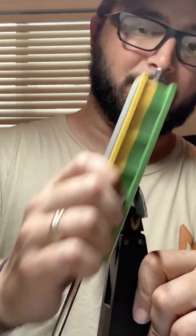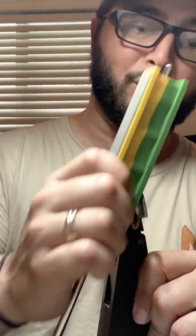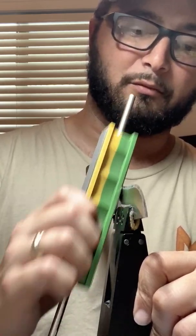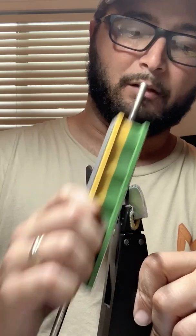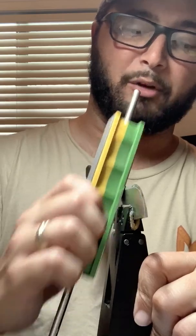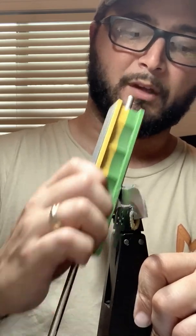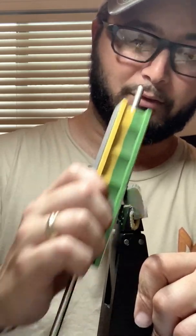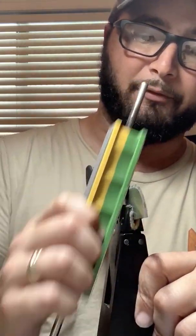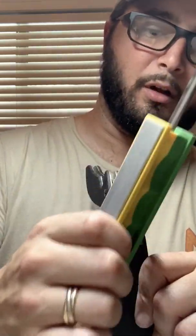So I know earlier I said the mirroring is purely aesthetic. Depending on how you use the knife and what you cut through, I've found that knives with the mirrored edge on them tend to last a lot longer sharp, and simply need a little ceramic hone to touch up rather than having to sharpen them over and over again. I found, at least in my use of the knives, that the factory edges wear out a lot faster, and for some reason the mirrored edges seem to hold an edge a little bit longer.